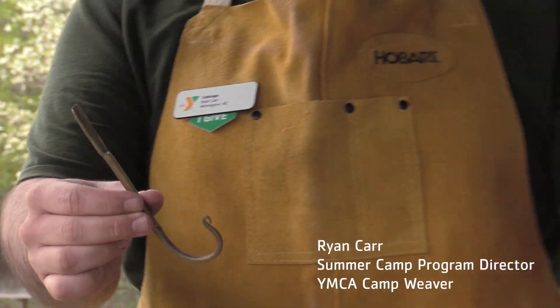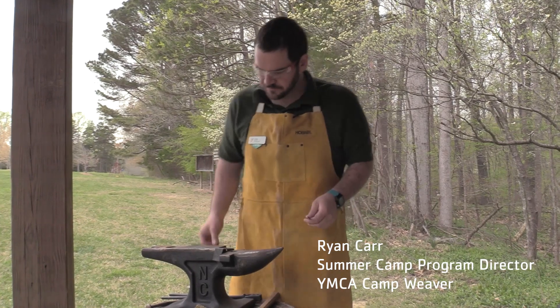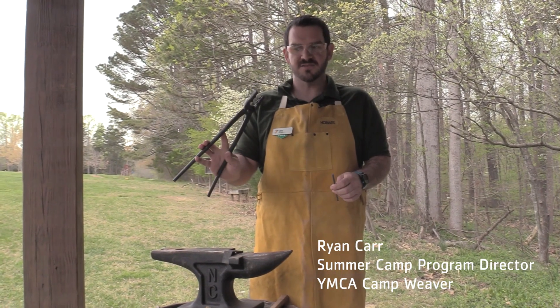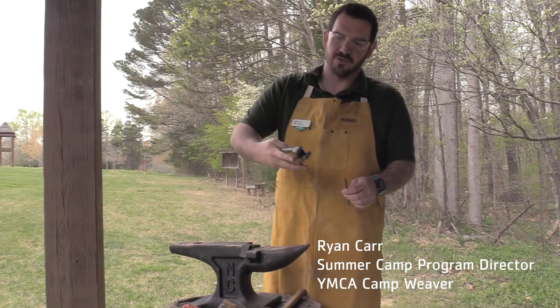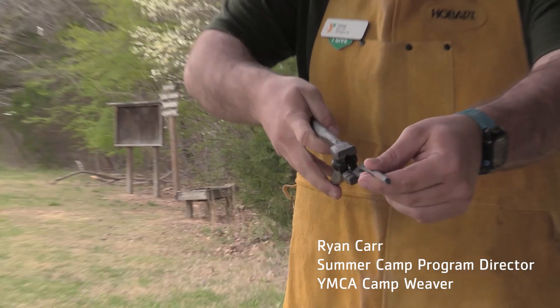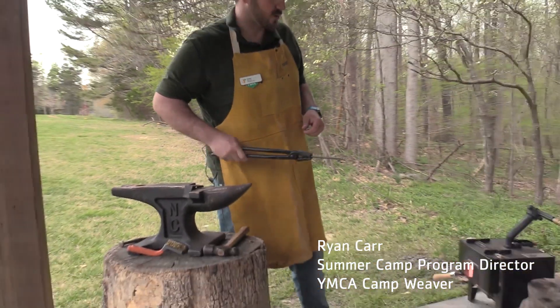The first thing that we need to do in order to manipulate our piece of steel is go ahead and heat it up, because right now I am holding them, they are both cool and I can't really move it while it is cool. So I have got a pair of tongs — if you look right there at the end you can see they have got teeth in them. I will stick my piece of metal right there into the teeth, close it up, and then I am going to stick this in my forge which I have right over here.